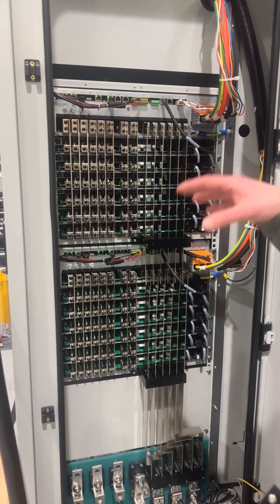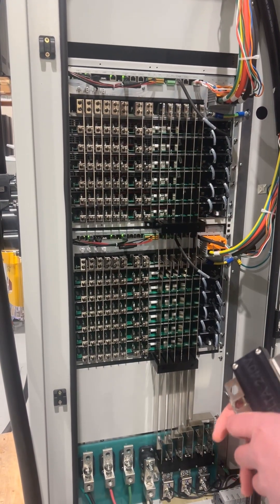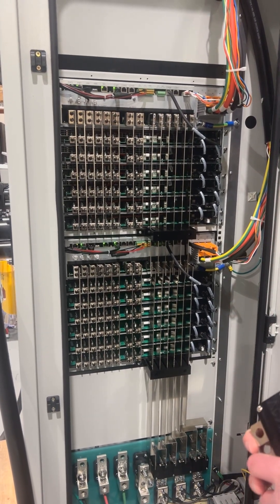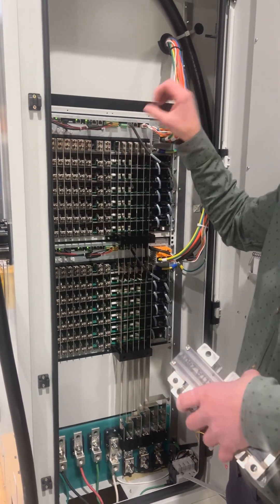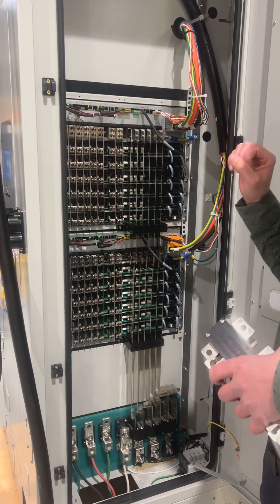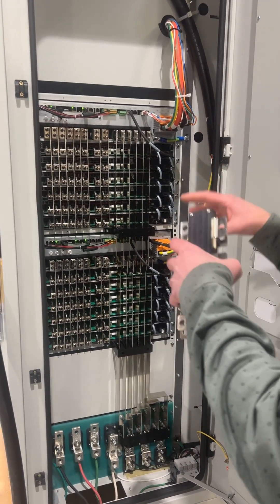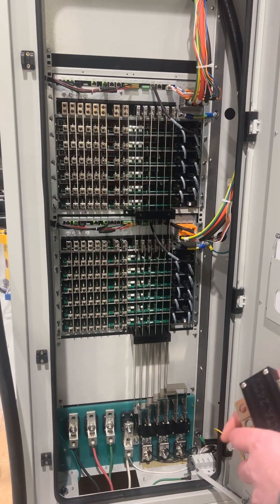We're accumulating that power in our DC rail up to the top of the rack controller and out to our CCS1 cables on the outside. In this particular configuration, there are two outputs — two CCS1 guns — and that's what you see here on the back side in terms of termination. All the communication is done through this top box, from the screen on the front to car communication, to doing any power conversion for any of the other low voltage loads.